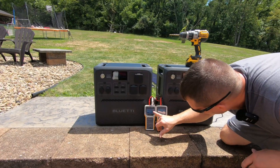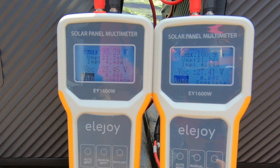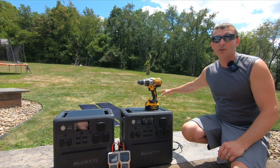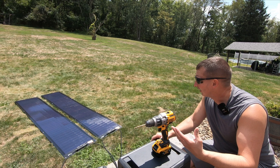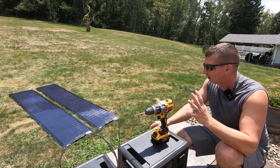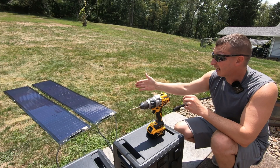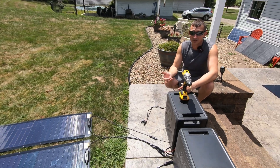Currently they are producing 98.29 watts out of this panel over here and 100.7 watts out of the panel on the right side — so about one to two watts more out of the right panel. I'm going to drill the panel on the left, the lower wattage one, because I don't want to ruin the one producing a little bit more power. You'll find a little variance between solar panels — these have produced up to 110, even 112 watts when cooler.